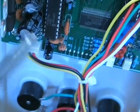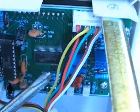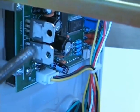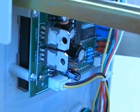There's a PIC 16F690 microcontroller, so I wouldn't have expected that, but they've used a PIC. They've obviously got a display controller here too. I don't like the look of these two TO220 voltage regulators — they're just free-standing. If you're experienced with PCB component construction and vibration testing, you'll know that this is a classically bad technique. These should be bolted down and secured in some way; otherwise they vibrate off. If you had this power supply on a trolley in a factory, these things would just fall off in a matter of days or weeks through sheer vibration.